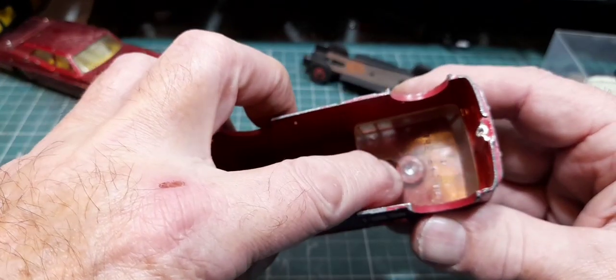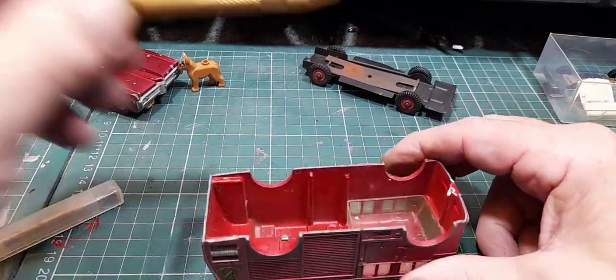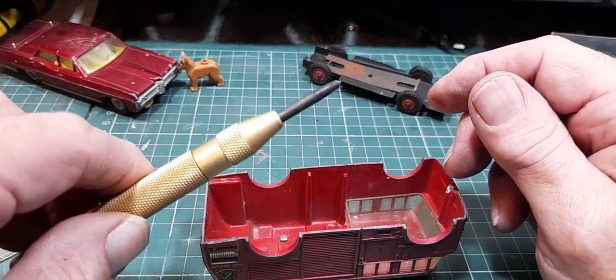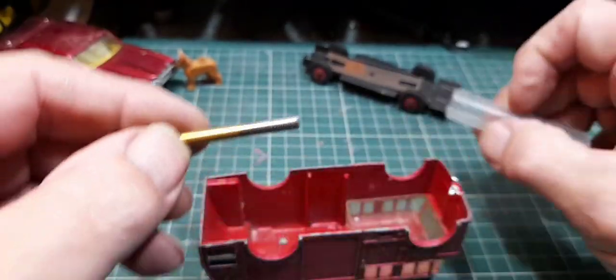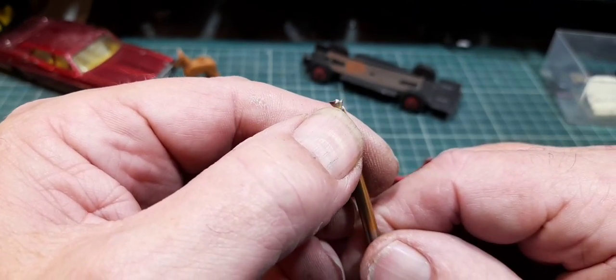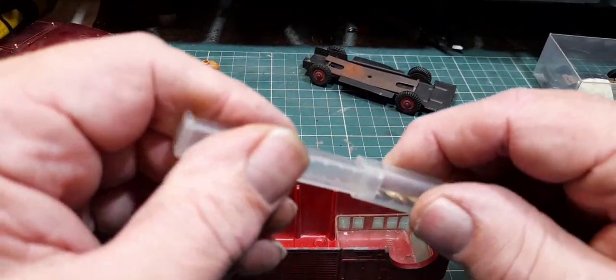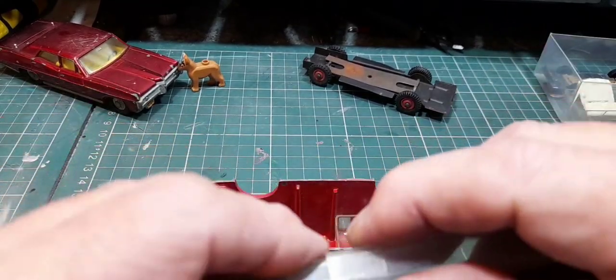This one - the glass has got a big mushroom-made rivet in there. I couldn't get a file in to flatten it off to start it, so I went in with a spring-loaded center punch - quite good, I bought it a while ago. Then I went in with a shallow drill bit ideal for this sort of thing - the point has gone on it now so I need a new one. I can't sharpen one myself. I tried and buggered it up. Anyway, get in there and it's gone.